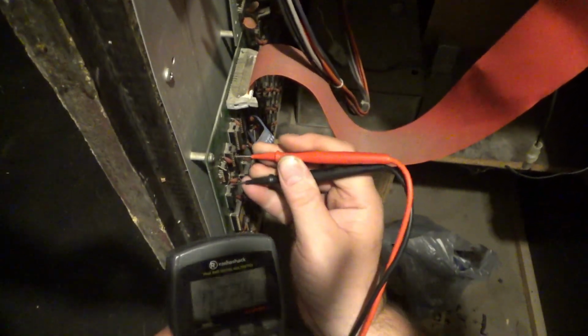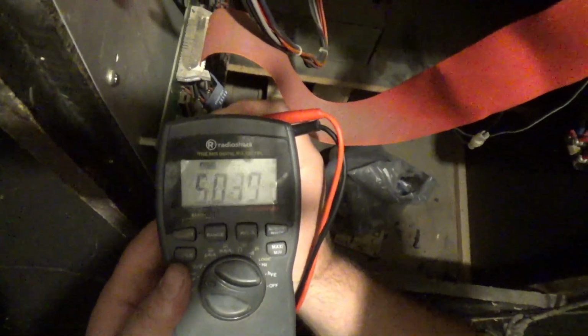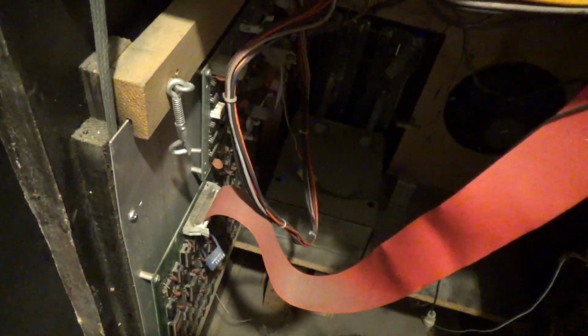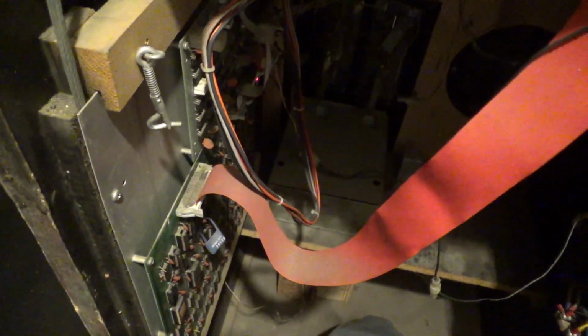It's hard to do this one-handed. 5 volt, dead on. Beautiful. And the LED flipped on and switched off, but oh, now it's on again. There's definitely a bad connection somewhere on the board. And I see lots of rusty legs. So I guess next thing to do is to clean up all the connections on the CPU board, and then maybe we could try it with the monitor power hooked up.